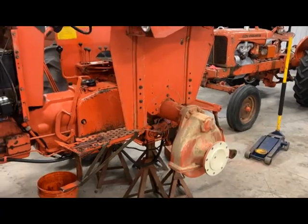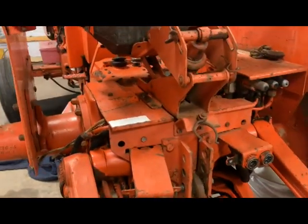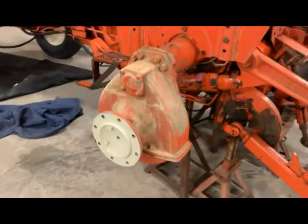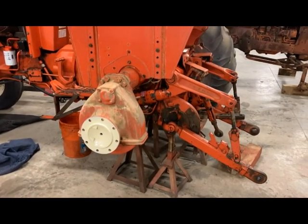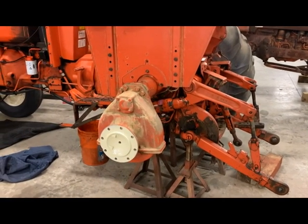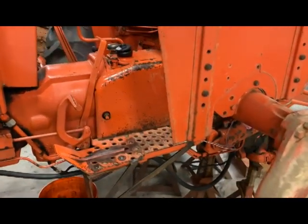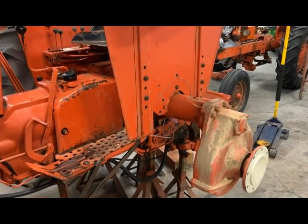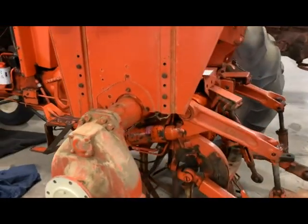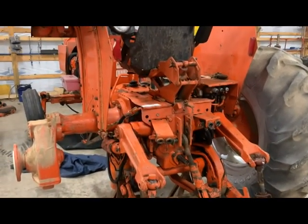On the time-lapse we finished reassembly on all of our sheet metal, seat components, and the cover for the brake assemblies on top — we've got all that squared away. The only last thing I'm going to do, once this back left rear tire is installed, is set the adjustment on that brake on the new one we just put in. The adjustment you're really doing is the travel between the drag of the brake shoes on the outer ring to the drum — we didn't change those, same shoes and everything. Anyway, hopefully that was helpful if you're working on a 175, 170, or even the 180s and 185s which are very similar. Thanks for watching — hit like, subscribe, share the video, and we'll see you next time.